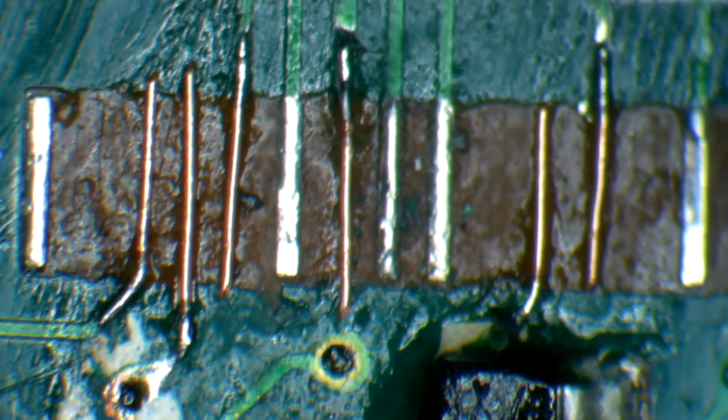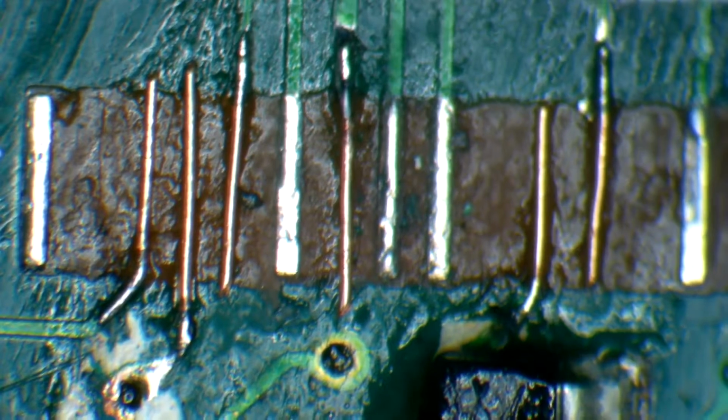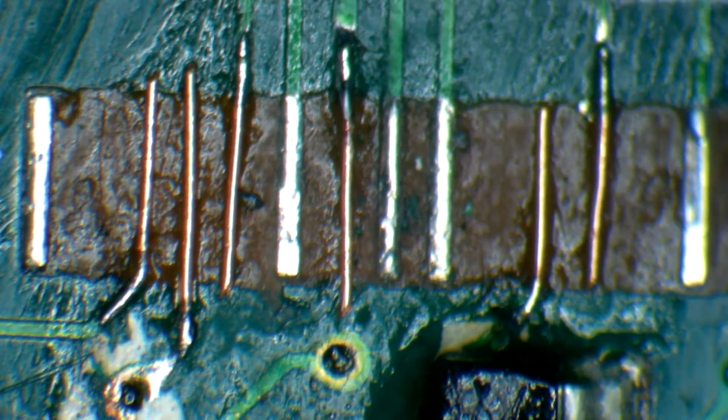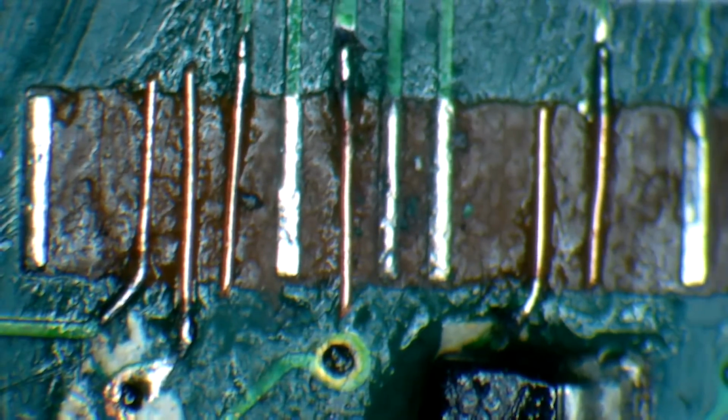So we'll go ahead and grab our solder mask now. I usually like to use either a paper towel or a little bit of waste paper. You can use anything to put a little bit of solder mask in, so then you have a place that you can pull solder mask from as a little reserve. Now I'm going to set the solder mask off to the side here. All right. What I'm going to do is take solder mask on my tweezers and coat the area entirely with solder mask.